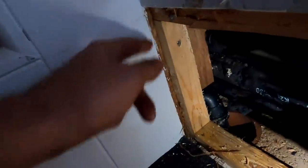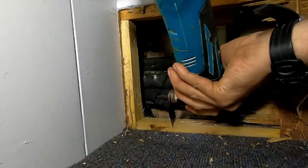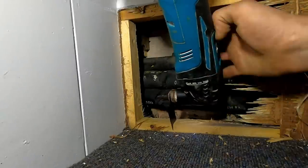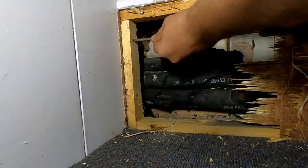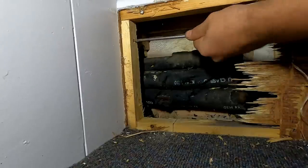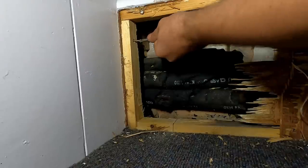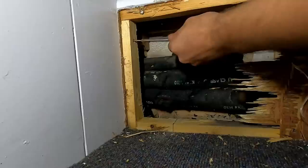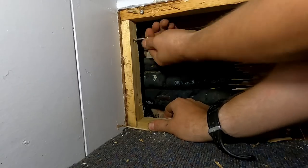What I'll have to do is cut this boxing out, get a rubber bung in that drain, and then sort that waste pipe — it's push-fit as well. I don't carry a lot of push fit so I'll have to take that bit off and multi-tool it, and all this boxing too. That's all I can do. I've got this out of the way now. No wonder it stinks, and no wonder it flooded over when they did the drain. I just hope I've got a bit of push-fit waste pipe or can convert it to solvent.